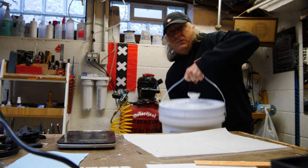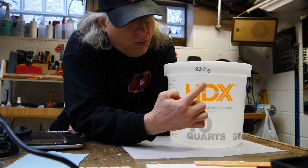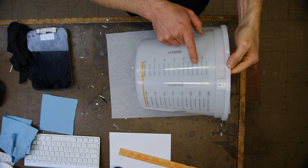This mold requires well over five gallons — around 20 liters — of silicone. I've already marked out the weight of this container so that when we place it back on the scale with silicone in it, we know how much it weighs already. I fill it up to about three or four liters right here because we want to allow room for expansion in the degassing tank.